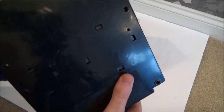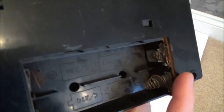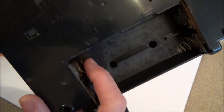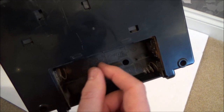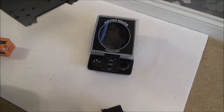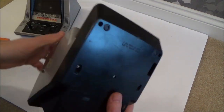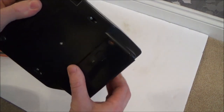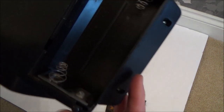Let me show you the very bad one to begin with. You can see that the spring here is completely eroded away and there's a lot of rust on this side. It's not even worth testing this one because we'd have to clean the spring and pull it right the way out — this is obviously going to need a spring replacement. Now there may be other faults with this that I don't know about, but when they were put away as far as he remembers they were working.